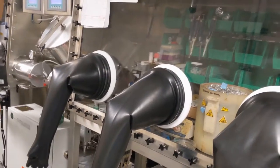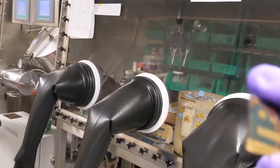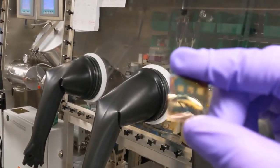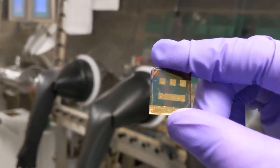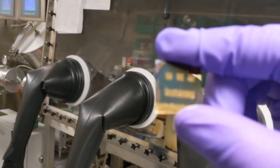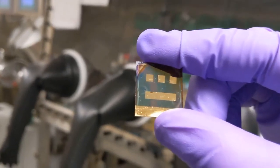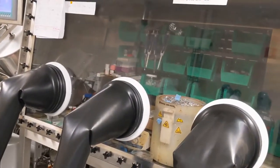This is the device room — this is where we make our perovskite solar cells and other types of devices. The finished solar cell looks like this: there are little squares and a rectangle, which are the actual solar cell device components. The background is the perovskite layer that covers the entire substrate. Then we put gold, silver, or aluminum electrodes on top, depending on the device, and that's how we get the final device. Each of these steps can be done in this room.